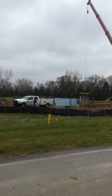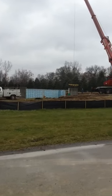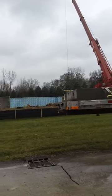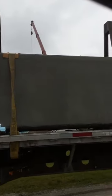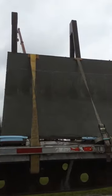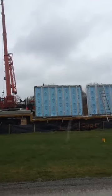As you might be able to see in the video, there is a brick ledge built right into the profile. I'm going to pull up so you can see a closer shot of the walls. Here we have the essence of this basement taking shape. Here's the wall sections — you can have a look at those right there. These smaller ones are the 48-inch footings for the garages, again with the brick ledge already built right into them. This is the window well for egress right here, and there's some of the wall panels right there waiting to be set.